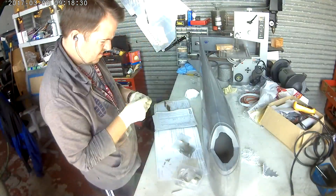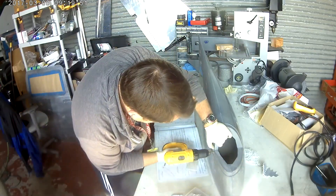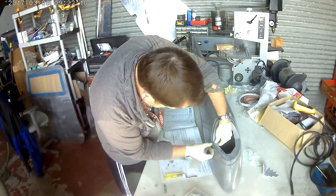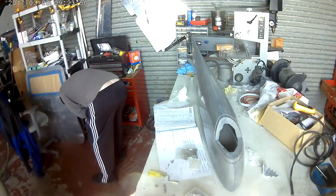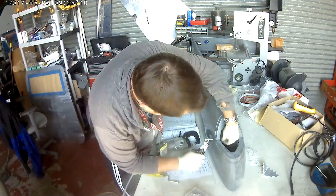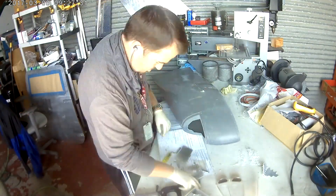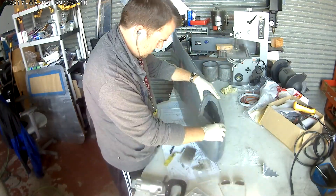Normally you can actually buy plexiglass bits, but why buy one when I've got a bunch of spare old number 40s laying around that I can just make? Once you drill those holes through, you then enlarge them to a number 27, because that's the size of a number 6 screw. You can then use one of the nut plates — the exact same nut plate we're using around the edge of the wingtips to hold them into the wing. Put the nut plate on with the squeezer, and then Bob's your uncle.